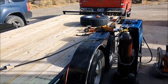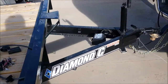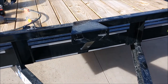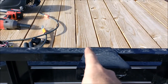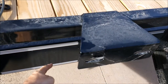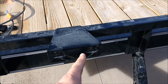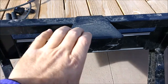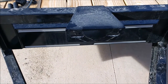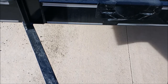After I get this done, I'll start working on the winch mount and the trailer box. I still need to buy the winch and a battery for the box. I'll have to build a frame across here to support it. One reason I wanted to use this cross piece as part of the winch support is to bring up another piece from the bottom about the same width — I should be able to weld a couple posts on to mount the winch to. Alternatively, we could make the winch removable with a receiver so it can be put in and pulled out and used on another vehicle if needed. Either way I'll need to build a platform across the bottom to support the box and the winch.